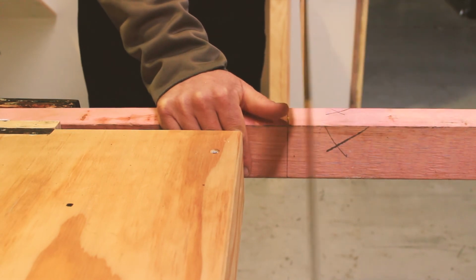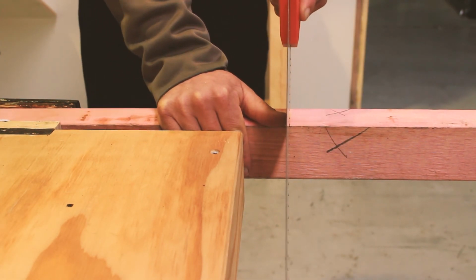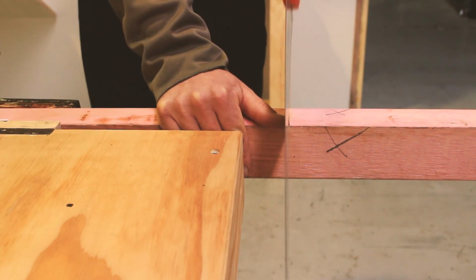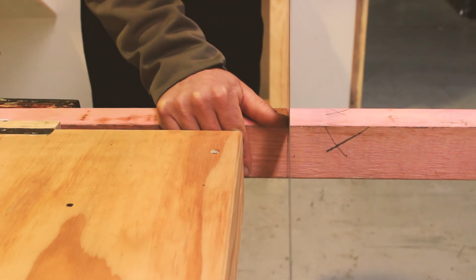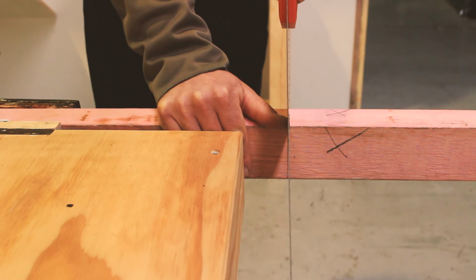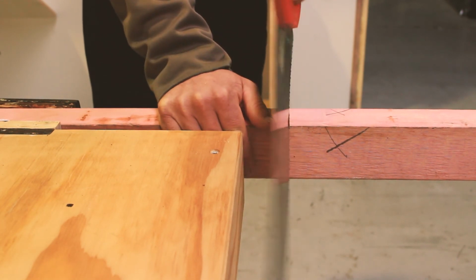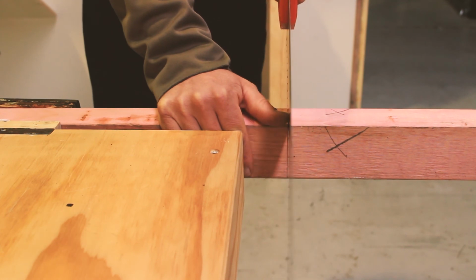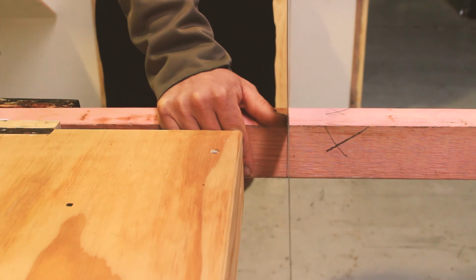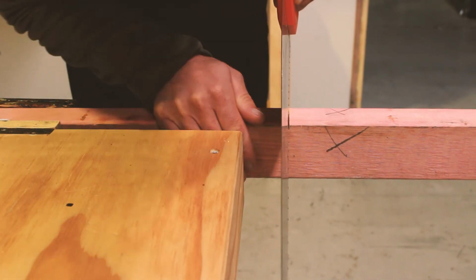I'm calling this the initial incision critical factor. And now I reckon I can actually do a draw and a push stroke. Now, I'm just assessing that as to whether this is half on the line on the top, but trajectory is really the angle of this blade here. I want it to be square, I want it to be plumb, I want it to be vertically level. And I can monitor that through sight, what looks right, and just down the side here.